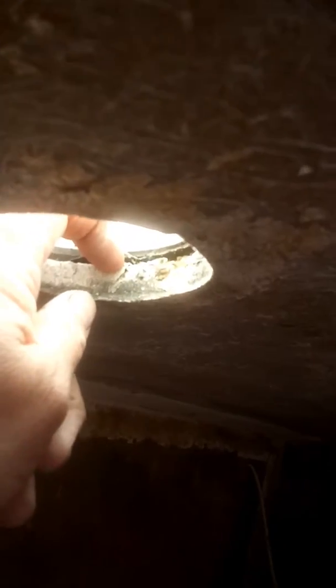We're having a quick look at the reasons why I'm not a great fan of balsa core decks. Here's a vent that's been cut through the deck and you can see the thickness of the core quite clearly. On top of that, you can see that it's actually detached from where the water comes through.